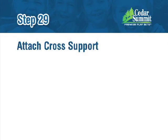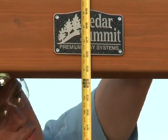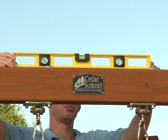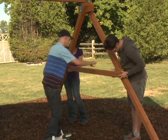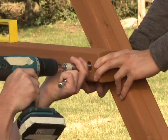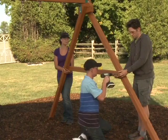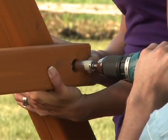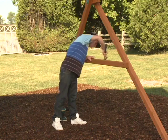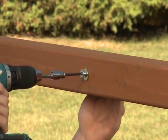Step 29: Attach Cross Support. Make sure the engineered SW beam is level and the bottom of the beam to the ground measures 85 inches. To adjust for uneven ground, raise or lower the 290 support cross on the SW post. Make sure the support cross is level prior to attaching with the lag screws. Place the support cross between the SW posts at the previously determined spot. Pre-drill using a 3/16 inch drill bit, then fasten with one LS9 lag screw with flat washer per side — one side fastened on the outside and one on the inside. It is important that each side is positioned exactly the same as the diagram seen in figure 29.3. Tighten the lag screws when you are sure the support cross is level. Attach one WB8 wafer bolt with flat washer and T-nut to the support cross through the middle hole. Make sure the bolt is attached to minimize checking of wood.